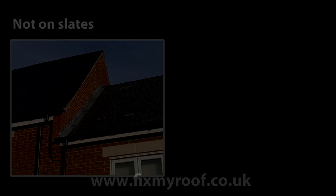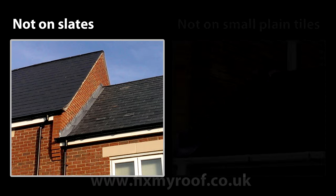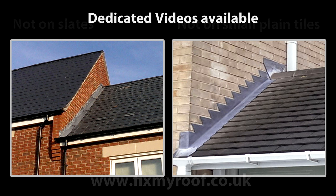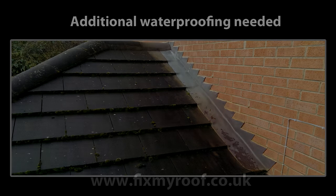However, the step cover flashing should not be used with either slates or small plain tiles like these, and I have dedicated videos available via the link at the end of the video or in the description bar if you need them. Step and cover flashing should also not be used with large flat tiles like these without additional waterproofing measures, and you can see this information via the link provided.